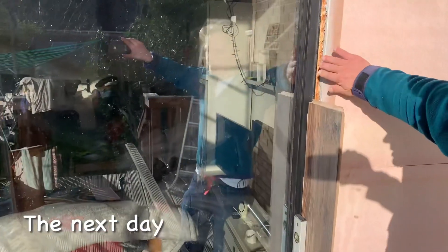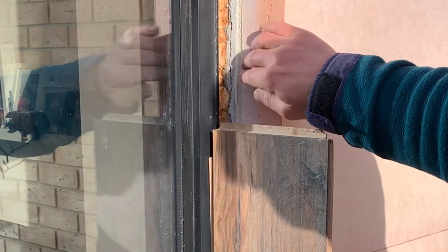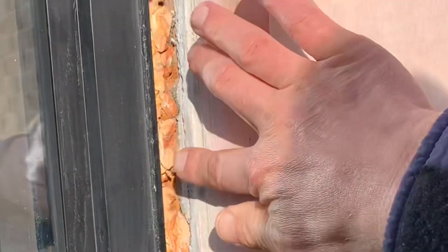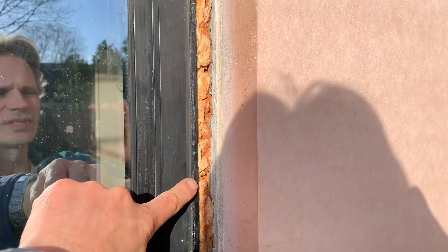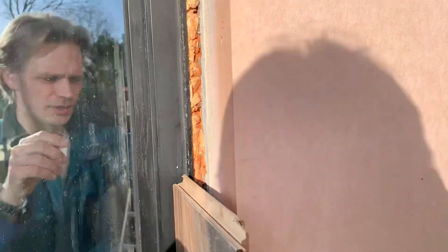I've cut and fixed these boards to make sure they're absolutely flush with the bit of wall here. But there's still a little bit of wall here and I want to insulate as much as possible around this bit so that I keep the window frame as warm as possible. One of the key things is we get condensation on the inside of this window, so I want to keep that as warm as possible. I've got some insulation that's as thick as possible to fit in there — this is two and a half centimeters.